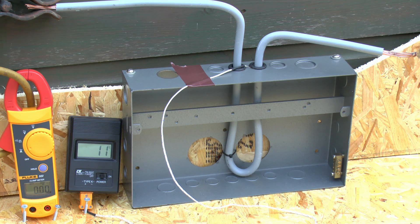It certainly seems that this problem is not particularly evident on lower sized supplies such as up to 100 amps, which is typically what you would find in your average house. Nevertheless, wires going through different holes does not comply with BS 7671, and of course they should go through the same hole in all circumstances. But until next time, thanks for watching.